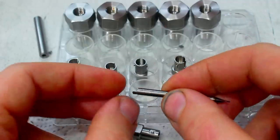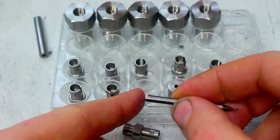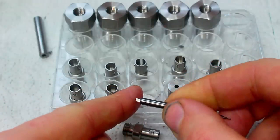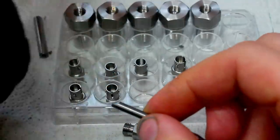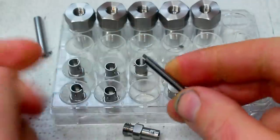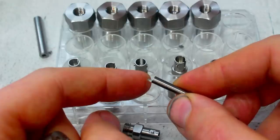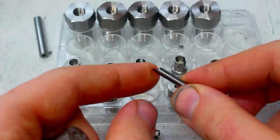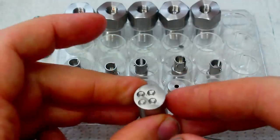It's acting like a single flute hole saw, for example. It cuts a round groove, and while it cuts the groove, it creates a pin and an OD. Creates a feature like this. And I will have a video showing how I grind this tool on the tool and cutter grinder, and how I came up with the geometry. That's a separate topic because it's a little bit involved.